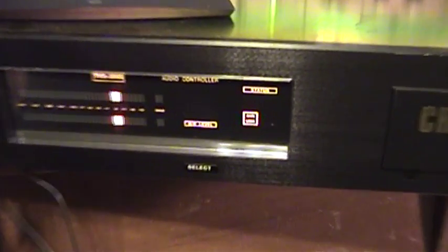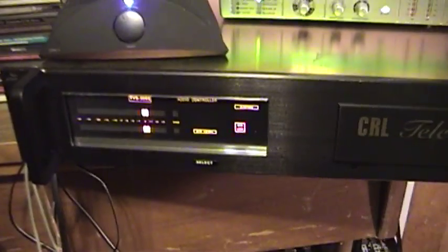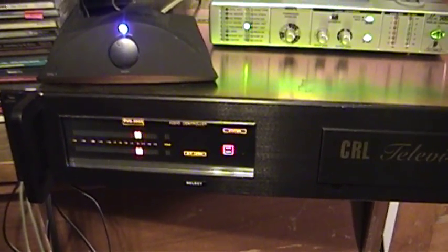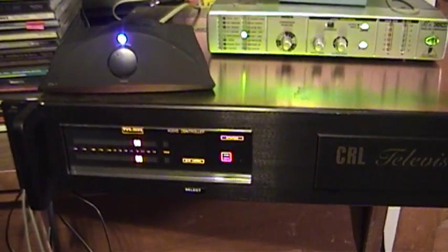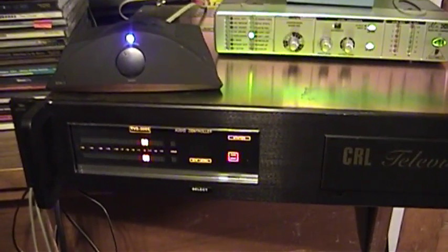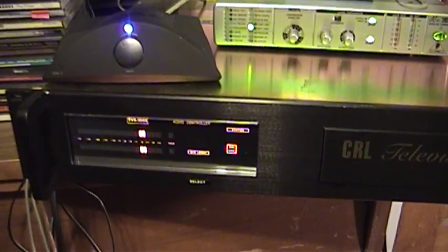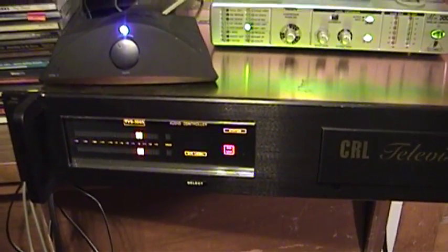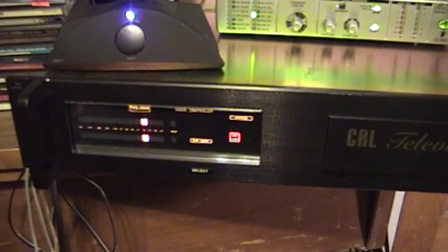You can see there is an indicator marked Gain Lock. What the Gain Lock function does is this: when the incoming signal gets quiet enough, if this thing did not stop turning up the gain and reducing its level of gain reduction, the noise floor would come up louder — tape hiss or record crackles, something like that. So when the sound gets quiet enough, this thing enters a Gain Lock mode where the gain settings will not move from wherever they currently are.